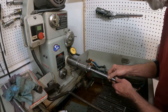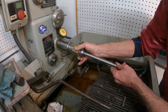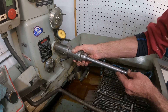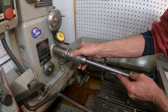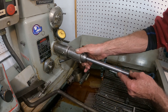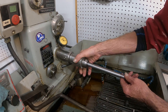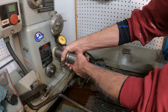You can buy or make an adapter so you can hook chucks onto it. This is a 5/8 Jacob's headstock spindle chuck with one and a half by eight threads like small bench lathes, and you can put small bench-length jaw chucks on here to hold parts to do external or some odd internal work.